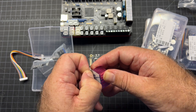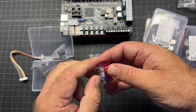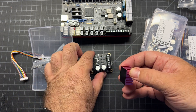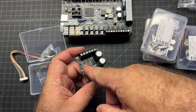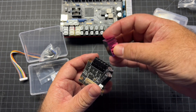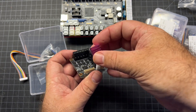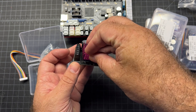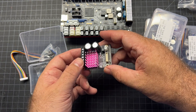Go ahead and remove the backing carefully. If you don't have fingernails, you can always use a hobby knife. The goal is we want to put these over these chips here. Try not to touch the capacitors while you're doing that. Just go ahead and carefully insert this as best as you can - that's how it should look. Repeat that for the other three.